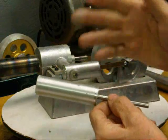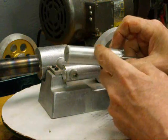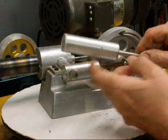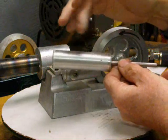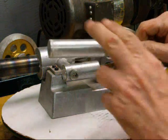This displacer is hollow, but it could be solid. I make it hollow to minimize the weight. This is aluminum. Some engines even use styrofoam — one of the other engines I've shown you uses styrofoam, but if you get very much heat it would of course melt. The displacer also has to be sealed. If there was a little pinhole in it you would have inefficiency, so you want it to be sealed.